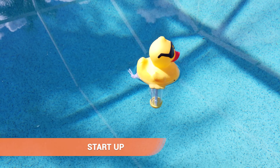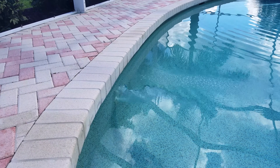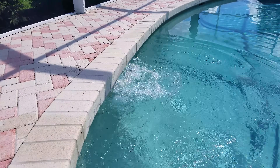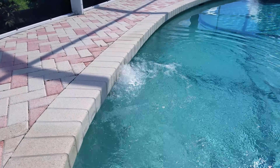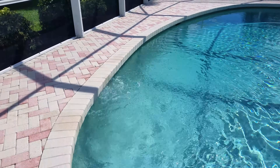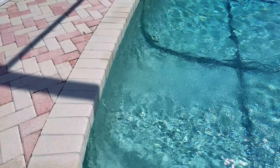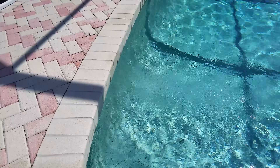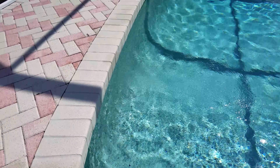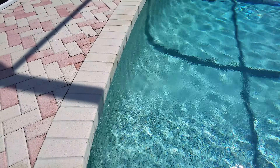Startup. When your solar panels first turn on, all of the air in the system is purged out by pushing it back to the pool. You will get large air bubbles coming out of your pool jets. This lasts up to about two minutes and is completely normal. Once all air is purged from the system, the bubbles will stop. You may occasionally see small champagne bubbles coming from the pool jets during operation. A small amount of bubbles is okay, but if you have lots of small bubbles, that could indicate a problem — we'll cover that later when we talk about your pool filter.